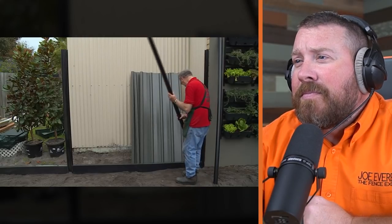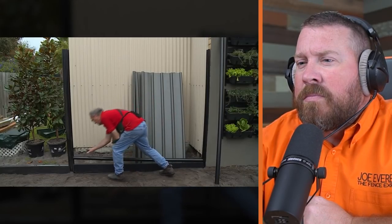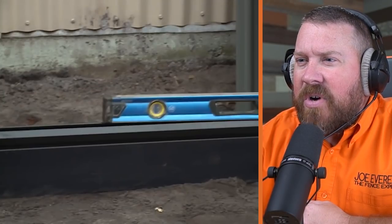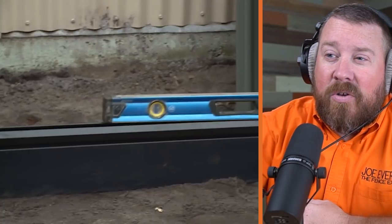The first step is to lay the bottom rail and secure it against the posts, then start putting the inserts in and double-check that the level is being maintained. In the previous UK video, D&J Projects used concrete posts and a concrete gravel board — some feedback was that they're really heavy and if they crack, water can get in, freeze, and break. These gravel boards sound like aluminum — lightweight but still preventing rot. This Colorbond system is completely metal, so rot's not an issue, and aluminum would prevent rust as well.